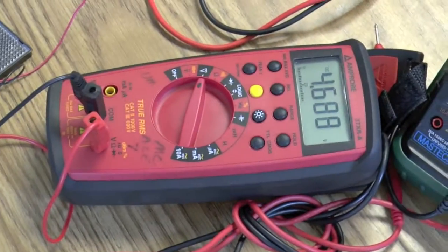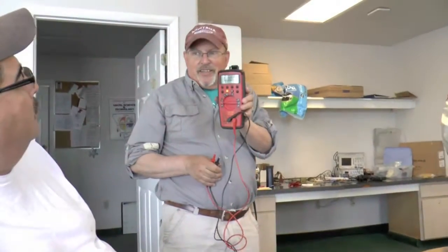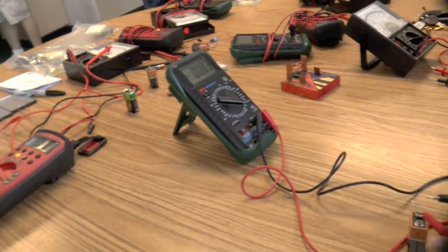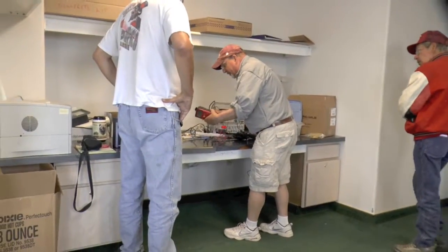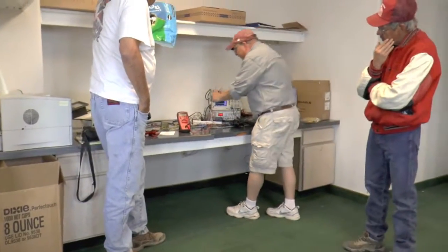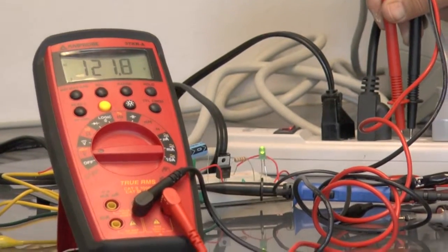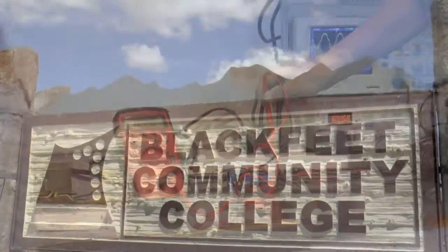If you hold it over the window and get more light, it'd probably jump up to what we've seen — because we know our outlets are 110 volts AC. You can come over to your outlet. Alternating current doesn't care whether it's the red or the black. You can carefully stick your leads into your outlet — right on the left — and you will see you've got your 110. This reads 120 volts because it reads AC in what's called RMS.